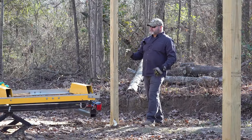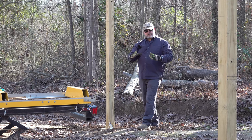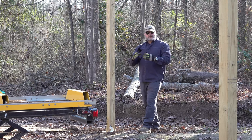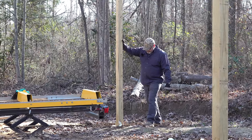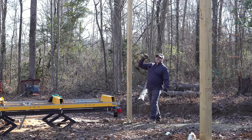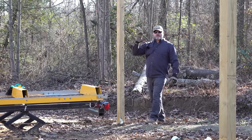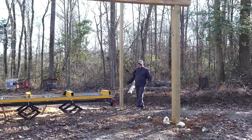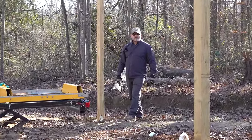It has been 30 minutes. We're on the back row of the future roof for the sawmill. These back posts were the worst because the holes were the same size as the front, but the foam had to be thicker - and the thicker the Sika foam is, the more it shrinks. These were just rocking back and forth before. Now they're like springs - the boards are going to flex, the 4x4s are going to flex, but it keeps on moving. Before, it was so loose that it just settled right back instantly. Now we actually have real tension and it's not moving in the ground. I feel pretty good about this, especially since it's probably only going to be here two or three years. With the Fast 2K in the hole now, maybe longer than that.